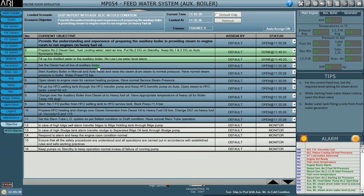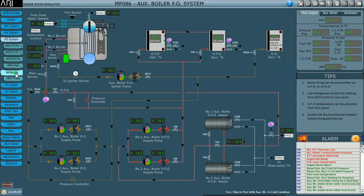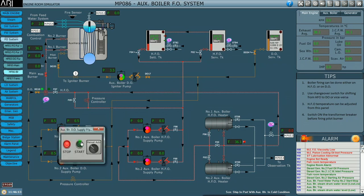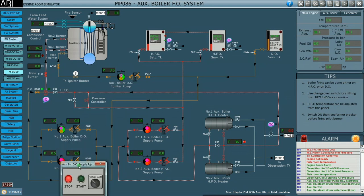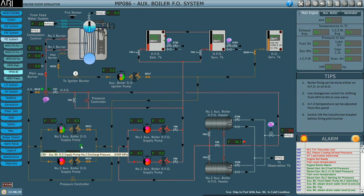The objective is completed — green. The next objective is to set the diesel fuel oil line of the auxiliary boiler. Go to the diesel oil or boiler fuel oil system. The pilot burner and main burner lines will be supplied with diesel. This is the pilot burner line — it's lined up, so start the pump. For the main burner, this is the diesel line — number one, number two, and through the three-way valve it goes to the main burner. Once the line is set, start the pump and put it in auto, keeping the second pump in auto as standby. Check that the three-way valve is in diesel oil — it was in fuel oil, so change it over to diesel oil. The diesel oil lines are set for starting the auxiliary boiler.